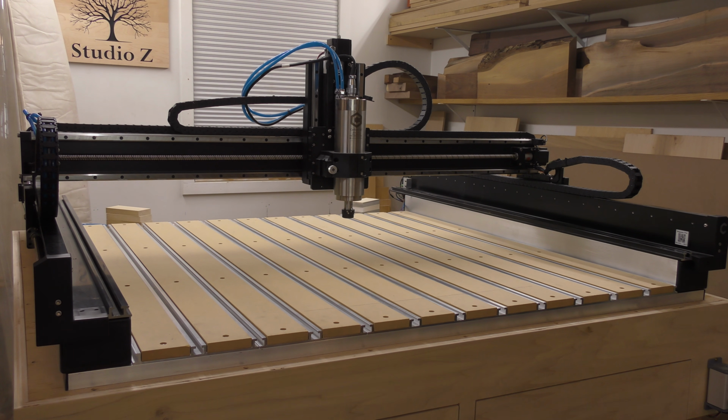And also, even on the drill press, I'm going to have to do it in 2 steps because my quill only has 2.5 inches of travel, I believe, so I will have to lower the bit on the second pass and go all the way through. All right, so I will mark all the holes, center punch them, and then I'll drill them out on the drill press. So I'll see you at the drill press.